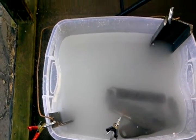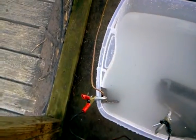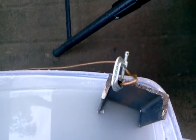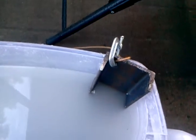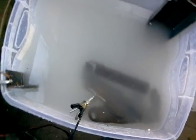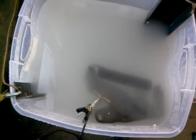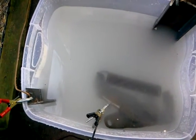I have two anodes, which are your sacrificial pieces. There's a piece of angle iron with a c-clamp tying it to copper wire running around to another piece of angle iron. The reason I've done this with two pieces is this is a roughly large piece, and this process is line-of-sight — it'll only work in direct line of sight from the cathode to the anode.